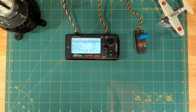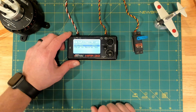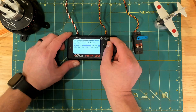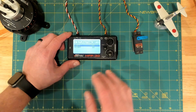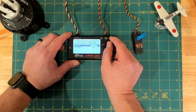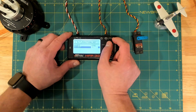When we go to set things, it wants us to put the jog wheel at center, and it gives little arrows for us to indicate which way to go. We select neutral, and since 40, 52 was what the center was, we go ahead and put it right back to where we had set it with the 25. So we select 40, 52, and now we go to the left and right endpoints. Remember, these are not relative to anything — these are absolute values. So it's negative 192 and positive 192, and if you can see the servo arm moving, it's going right to 45 degrees. We don't have to worry about adding or subtracting a center value — it's absolute 192 and negative 192.